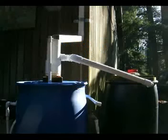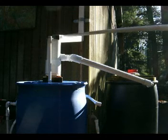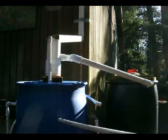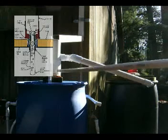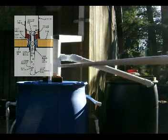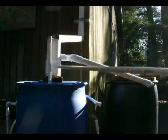The purpose of this device is to supply the cleanest possible water to the storage system. The way it works is water comes out the downspout here, goes through this four-inch PVC and into the barrel. As the barrel fills up, a little plastic ball inside a pipe hooked to the inside of the barrel floats on the surface of the water, all the way up, and when it gets to the top it seals this off.